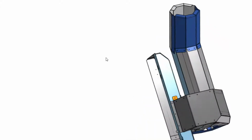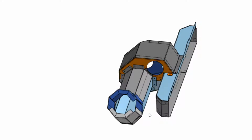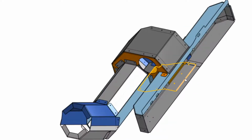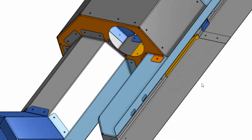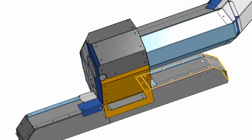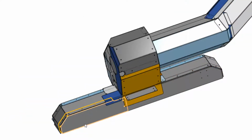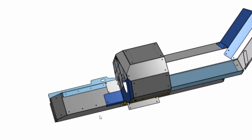let's look at this from the, it doesn't really show it on here. These two pieces on the bottom, when you receive them, will have tabs that stick out to the back here, and some of the tabs you actually bend down 90 degrees and some of the tabs you leave poking straight back. The video that shows how to bend the tin set for this model will show that, and the tabs that remain going straight towards the block actually sit on top of a casting boss.